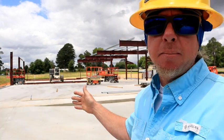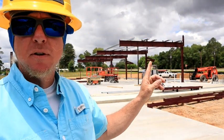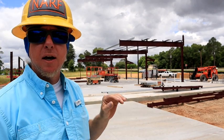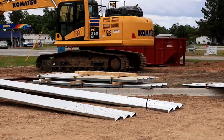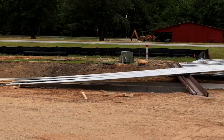If they were all stacked here near the interior columns — since I can't cross those anyway with purlins or girts because they're always wider than your column layout — I can block that section up anyway. Then I'd leave myself one trail in the dead center that I could come through and hang these frames. The big frames wouldn't be in the way, and the little frames would be in another stack that I could grab, come through my little trail, lift up, and set on these two columns.